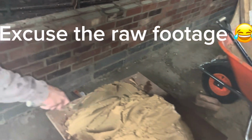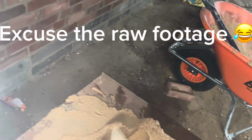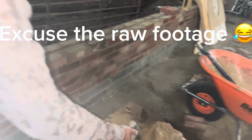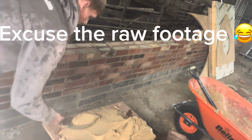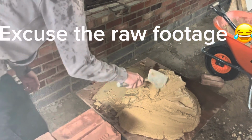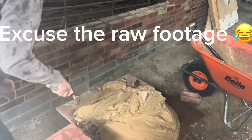Obviously you've got a bit too much off, so what you're trying to do is work out how much you're going to need. So when you cut it, I'm a bit cack-handed there because obviously I'm leaning over, but just cut enough for one trowel full. That's it. Not bad. But obviously what you're trying to avoid long term is making a mess. So that clear channel you get at the front of the board, that's to make sure you don't drop any. That was good.